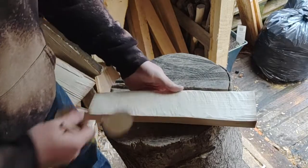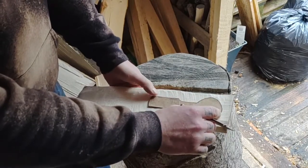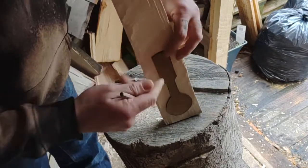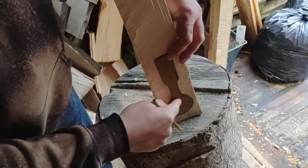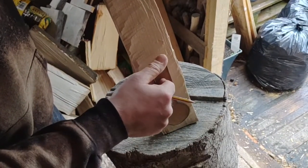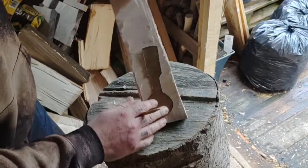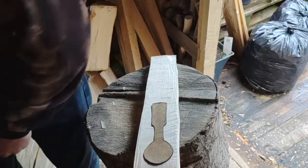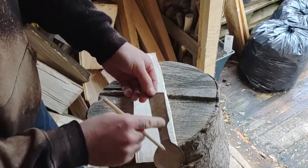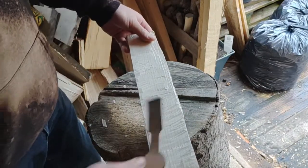Get your template and draw it on. I've got a very long piece of wood here — I'm putting the template here so I have space to cut the end off level afterwards, and so I can hold the work piece. We're going to be axing down the handle with the axe going down towards the bowl. I want room to hold my hand up at the end without risk of catching it on the axe blade. I've marked roughly where the spoon template is going to go.